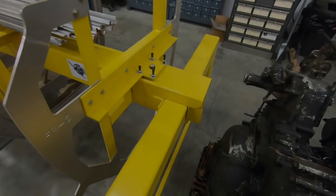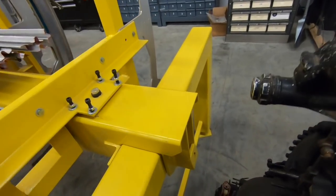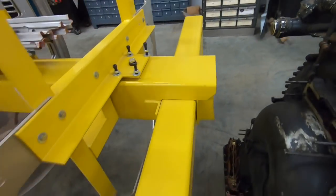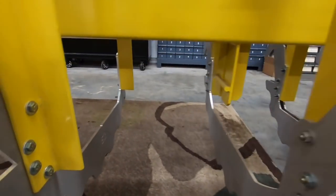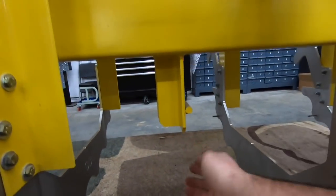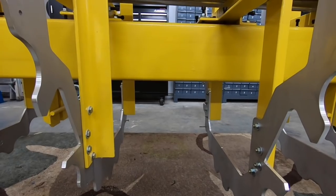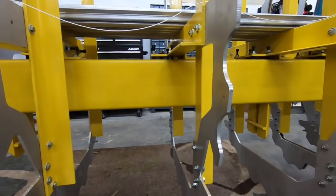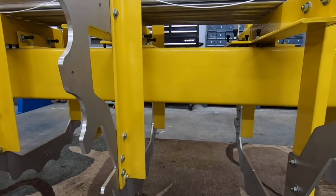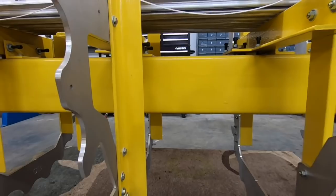So the spine is supported by two legs. It's both bolted and basically clamped to it. Very rigid structure, but we also have a tension rod that goes through here. It's not in place right now, but it comes through this hole. There's a nut on the end, and it runs all the way down under the beam to this point here, and it's supported underneath this round bar, and then there'd be a turnbuckle, and then the same thing, a rod supported under here all the way to the other end where there's a nut placed on the rod. The turnbuckle can then be tensioned or tightened, and it'll be allowed to take up any load that's put on this beam from the weight of the fixture itself, and possibly or potentially a technician inside when we're pulling the frame segments apart to get the monocoque off after it's complete. So it'll prevent deflection of the beam or allow for adjustment to prevent deflection of the beam under load.